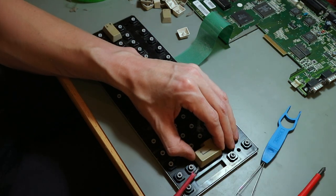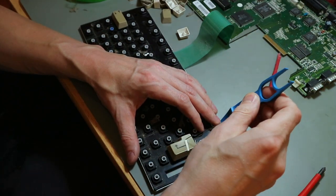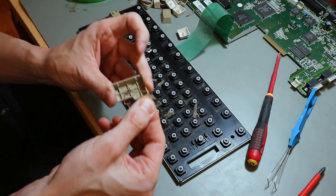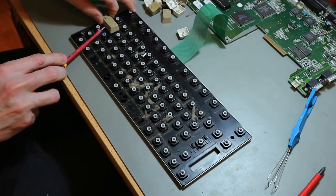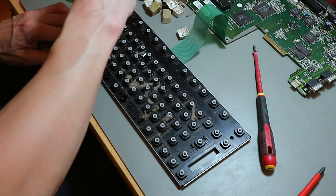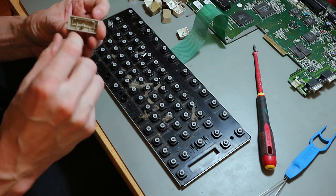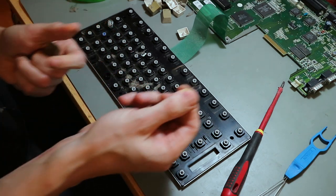The return key, and the caps lock, the tab is similar. One normal spring, a metal bracket, and check them out. It's not good to use a screwdriver. You can damage the keys, and then you must buy some new ones. There's also a metal bracket. Pull it out. It's dirty, no corrosion, in good shape.